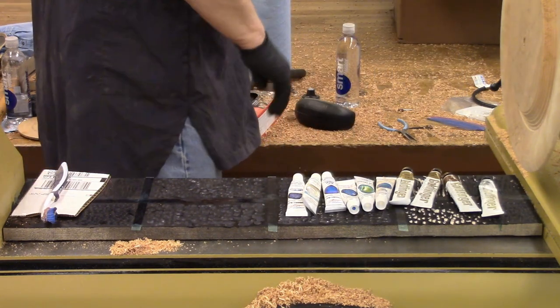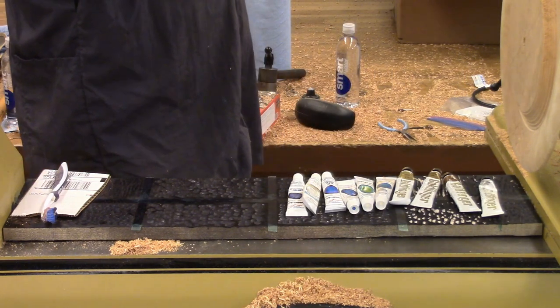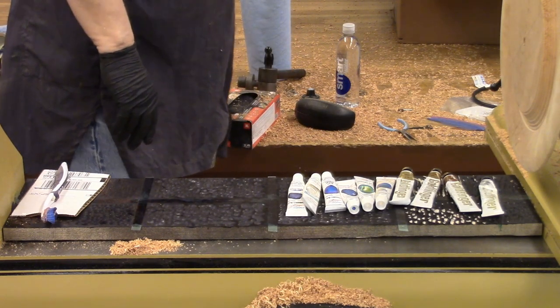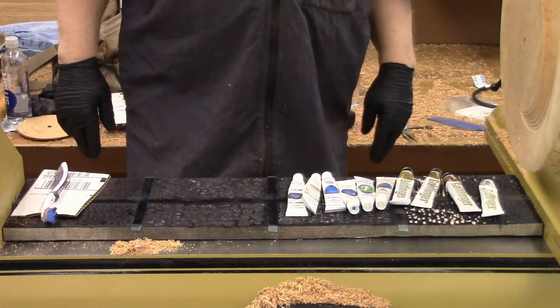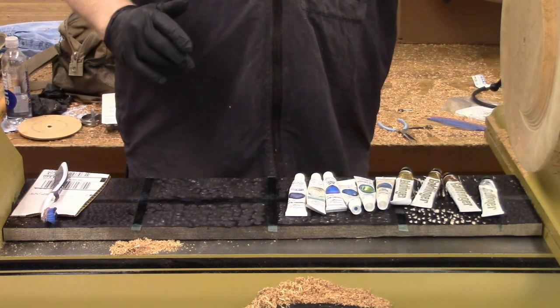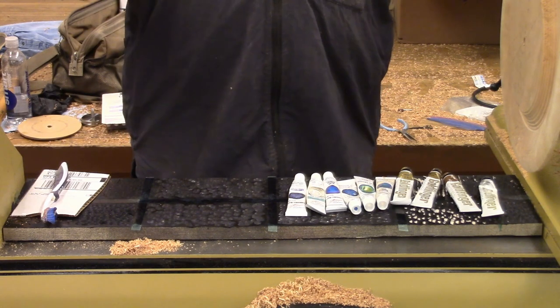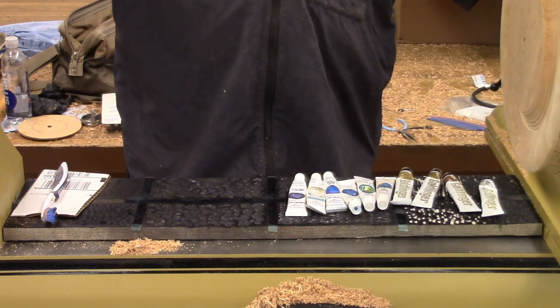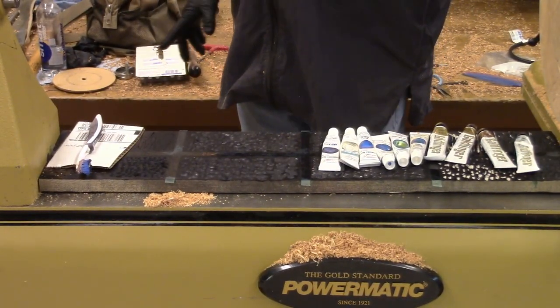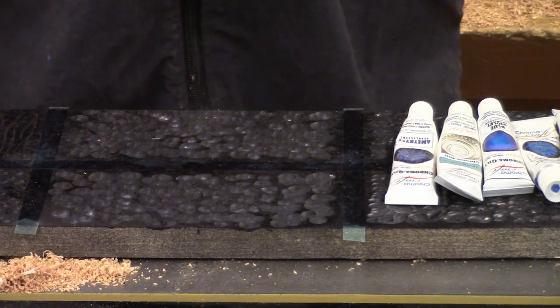What again is that black base that you put on? Dye. Chromacraft wood dye. If you haven't been to the website, they have a lot of product. It's black dye, leather dye. I use Transtint. You buy one of those bottles of Transtint, you get dye for the rest of your lifetime, because it's a 13-to-1 or 16-to-1 dilution factor with alcohol.